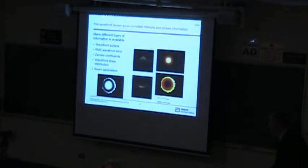So, the thing also to keep in mind is that at the same resolution of the lenslet, I can also count up the total amount of light underneath each lenslet. So that total light really is the irradiance of the intensity distribution as well, and it's at the same resolution. So I get an irradiance distribution and I get a phase distribution that I can measure.